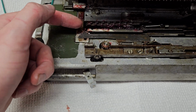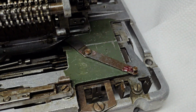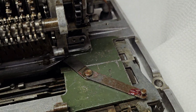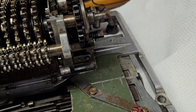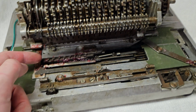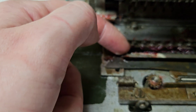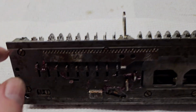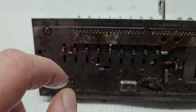And what happens is you'll see these pieces here popped up. And these are the same as division. They also interact. You see the clutch moving. It's not going to move much because it's already tripped. The first time I pushed that over, it engaged the clutch. So it's already tripped, so it's not going to move that much now. But you can still see it moving a little bit, hopefully, when I push on these two pieces. These two pieces, which are this little finger here and this silver bar here, are what interact with these fingers here on the bottom of the counter section of the carriage.